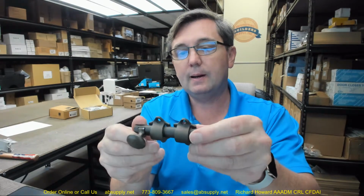Although one that has a size that would match bolts that would be typically longer than this. So it's a full-size decorative surface bolt in just a shorter length is what a Dutch door bolt really is. You don't need this to be long at all. You would probably not want it to be longer than this standard type of length. So a 279D by Hager is a Dutch door bolt.